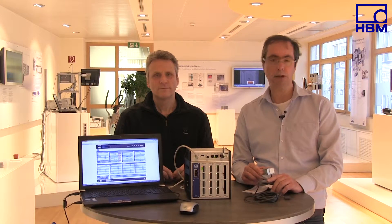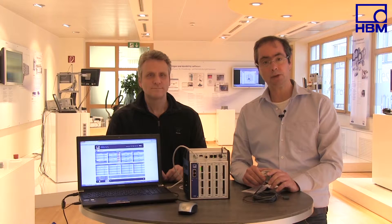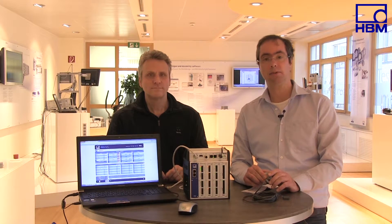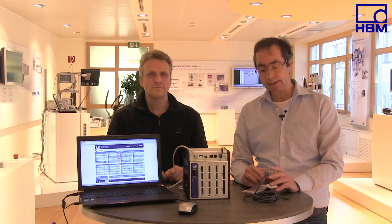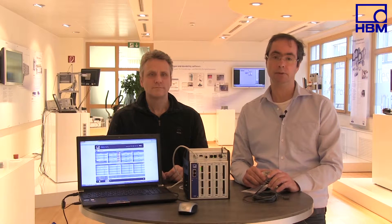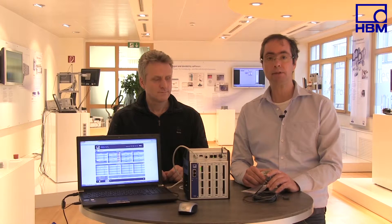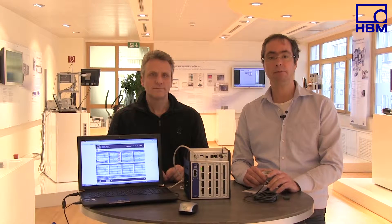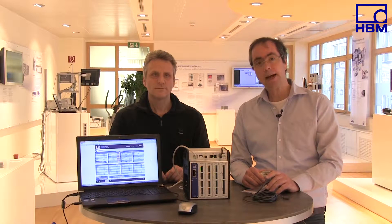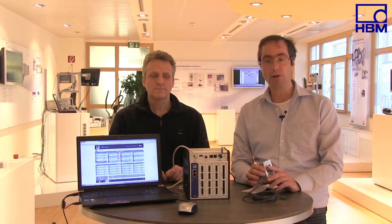The technical challenge is to ensure the correct supply voltage. In general, strain gauge based sensors have 350 to 1000 ohm resistance, which means that a considerable current flows through the sensor supply lead. The cable has electrical resistance, which results in a voltage drop in the cable.